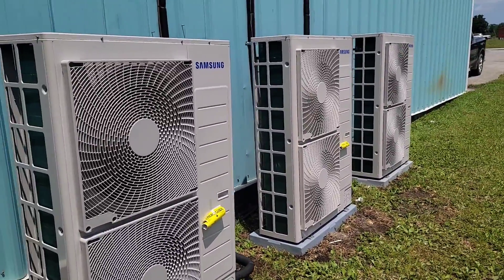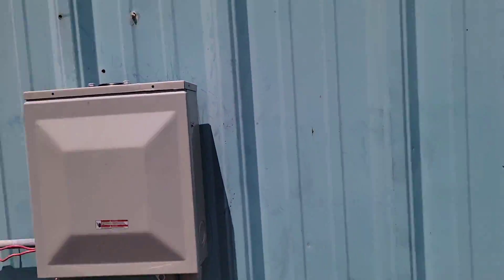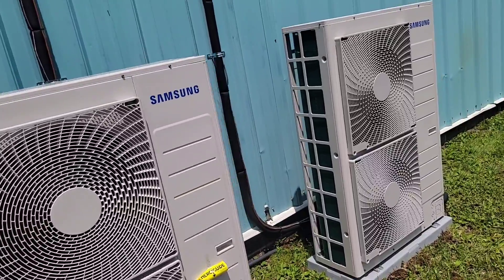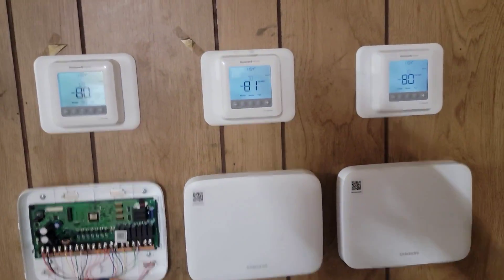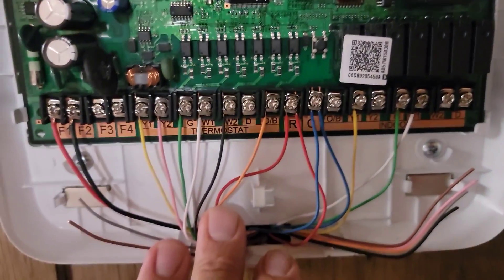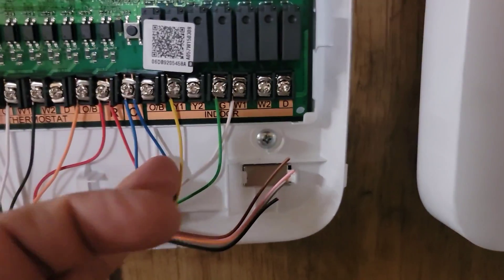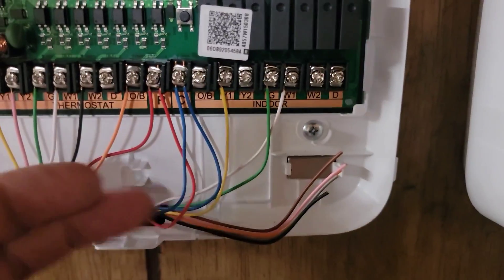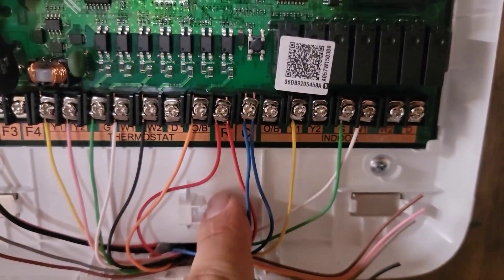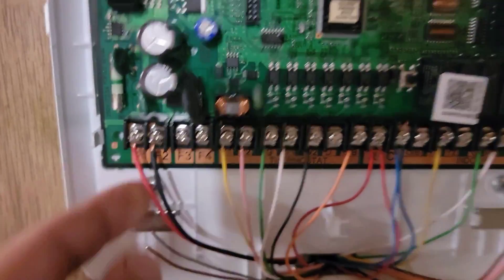Three five-ton Samsung Hilux condensers, new breaker box, single phase. Time for the startup. We've got our three T6 Honeywell thermostats set to cooling. Here's our air handler unit control kit — wired to our thermostat, wired to our indoor unit, our furnace. Our red and our common, R and C — that's our 24 volts. And then our communication wire to the outdoor unit.